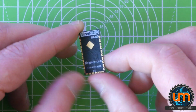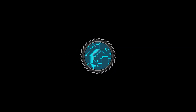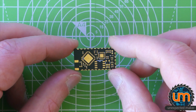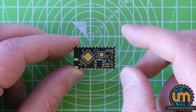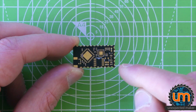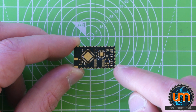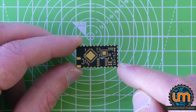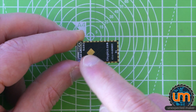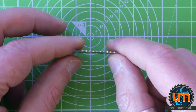It's time to build one of my tiny Pico Nano Rev1 boards. You can see it there, it's a Rev1. This is a tiny Pico that has everything on it except for the APA 102 - there's no RGB LED and no USB connector. But there are all the USB peripherals, so this can be put on a board that has any USB connector on it and can be flashed. It's a full microcontroller, using the Fractus antenna, and RAM is on the top so it's a single-sided board. There's a pad for heat transfer to help cool down the Pico D4, and it's a 0.8mm board.